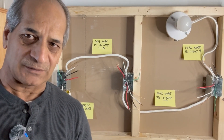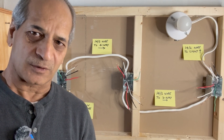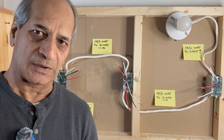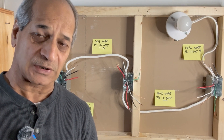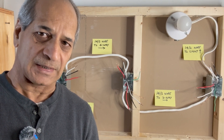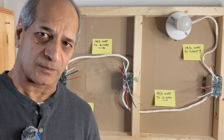So let's take a look at how the wiring is done and how the connections are made. A four-way switch controls a light from three or more locations, but all of the switches are not four-way. If we want to control the light from three locations, we need only one four-way switch and two three-way switches. If you want to control the light from more than three locations, like four locations, then we need two four-way switches and two three-way switches. In this simple example, I will explain how we can control a light from three locations.